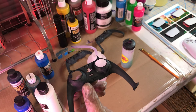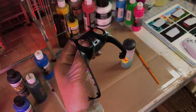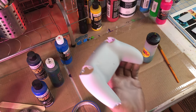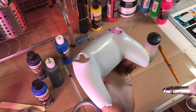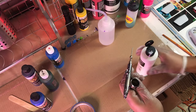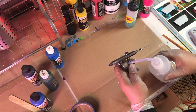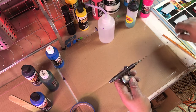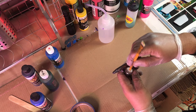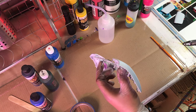You can see the difference before and after applying the Autoborne sealer. Don't forget to hit the edges — this way the paint doesn't peel from those areas when you're putting the controller back together. The way I prepare the Autoborne sealer is about 75% Autoborne and 25% water mixed together. It kind of looks like milk and you want that consistency so it sprays nice.